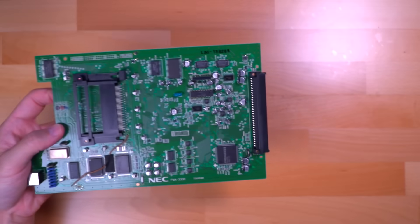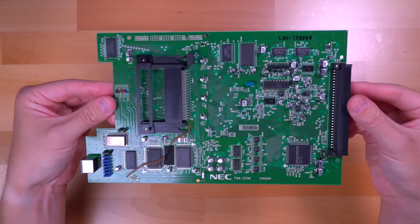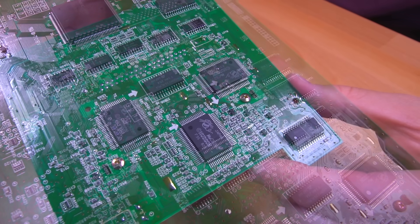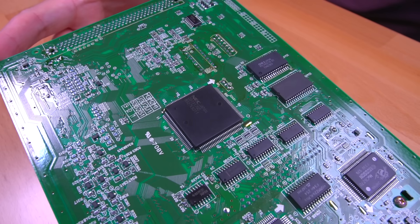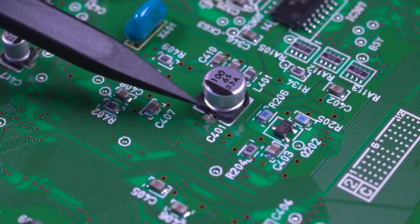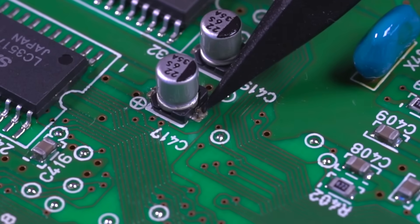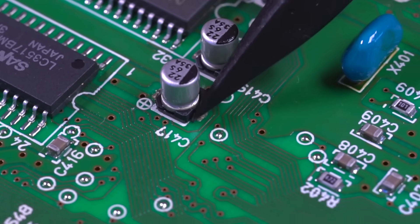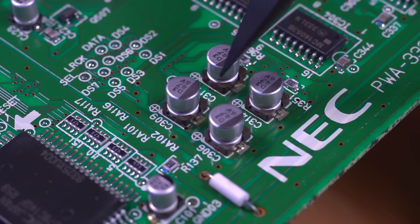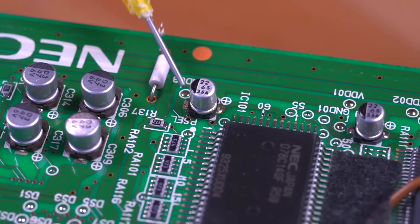Taking a look at the motherboard, I have to say that it's in shockingly good condition — it looks very clean, and there's no immediately noticeable signs of damage caused by leaky capacitors, which is great news. Here you can see the three Hudson chips, which makes this a PC Engine, as well as the beefy NEC chip for CD-ROM game support, and this Pioneer chip which allows the game pack to interface with the Laser Active system. Taking a closer look at some of the caps, many look to be in good condition. However, there are also quite a few that show some signs of corrosion on the leads, which is a sign of leaky electrolytic fluid. We caught these early, so there doesn't appear to be much damage at all.